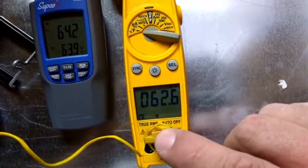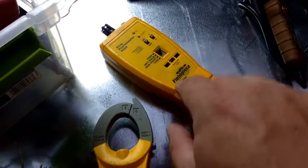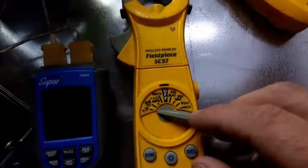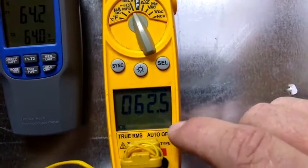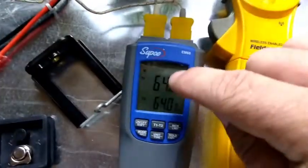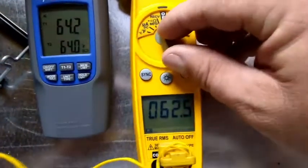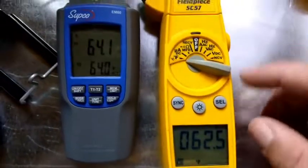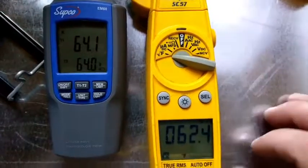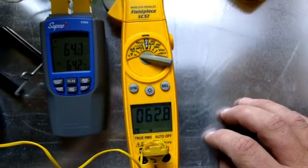I have a wireless transmitter and the AR H4 sling psychrometer head, so I'm going to switch to receive on this meter since we've already linked them up. They're sitting at 62.4 as well, so our Field Piece stuff is running about a degree and a half cooler than the Supco EM60. The Field Piece stuff agrees at 62.5 to 62.6 — really close. Overall, a degree and a half is not going to make a whole world of difference in most applications, but we can tell there's a little bit of separation.